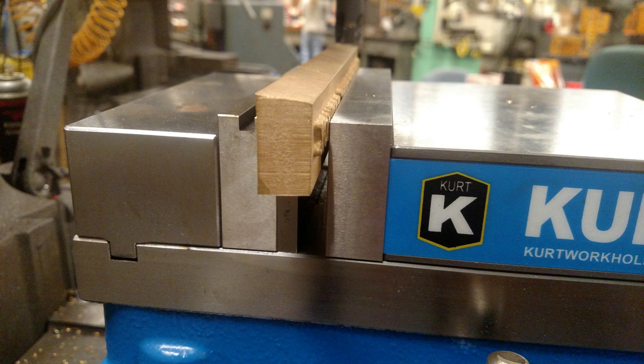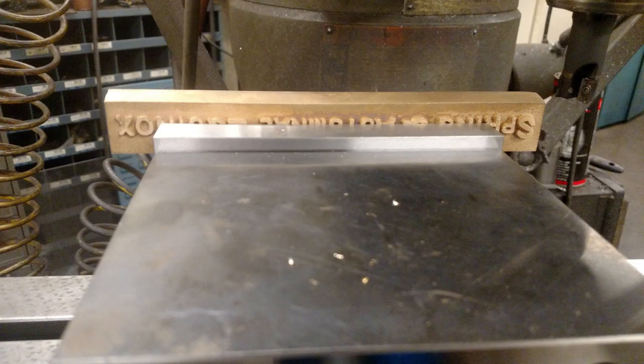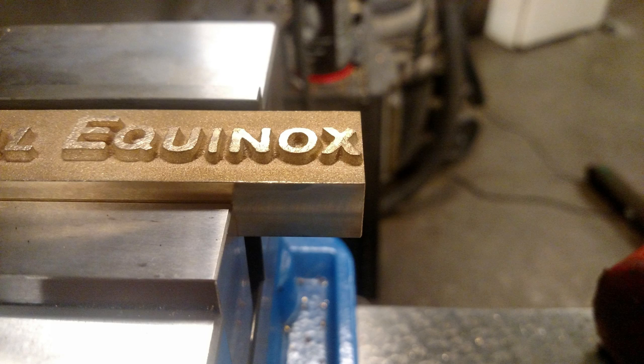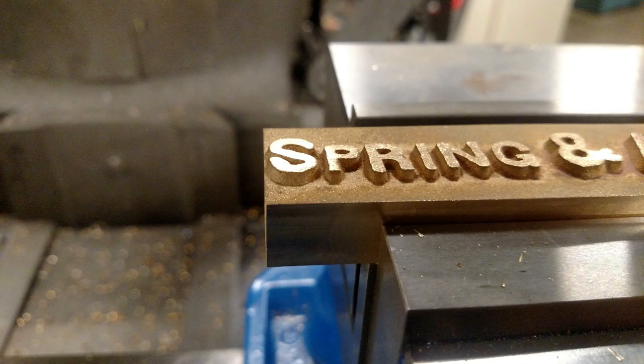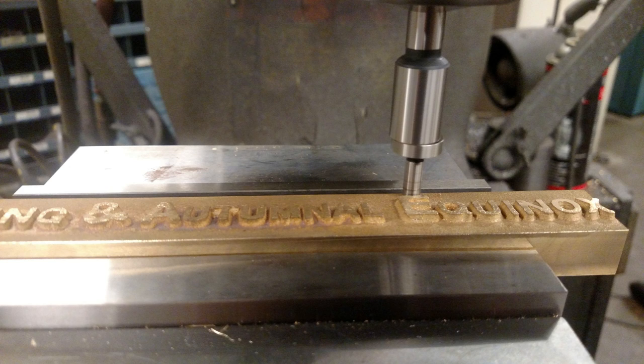The section that has the words on it also has draft from when it was cast — that's the angled sides so it can pull out of the sand a little bit easier. My first order of business was to square up each side of the piece so that I could hold it in the vise and cut the tenon on the underside. After squaring up the sides I squared up each end as well to make finding the edges easier, and I kept the letter spacings the same as they were on the original lettering. I found the edges on each side of the E and used that to center the tenon over the lettering — the E was convenient because it was the only letter on the piece with flat edges on top and bottom, but it did cause problems later because the lettering was nowhere near straight to the workpiece.